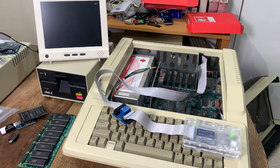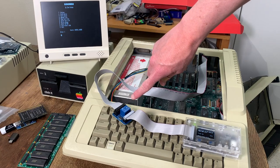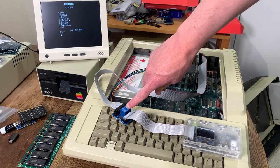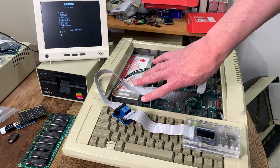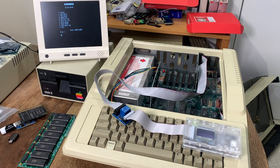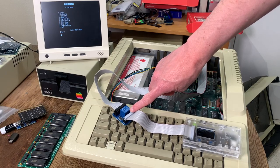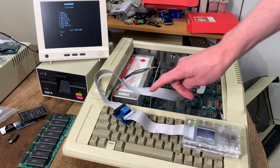I'll go ahead and turn on the Apple IIe. You can see it booted up Merlin 2.48. Every time it changed tracks on the disk, it flipped the relay inside the mechanical sounder. It doesn't slow down the floppy disk emulator at all — it's just responding to the track settings. Because I'm emulating a floppy disk, it really does take that long to boot up. Since this uses regular signals from the Disk 2 controller card, it will work with any floppy disk emulator.